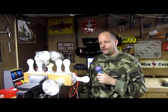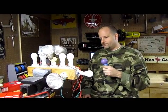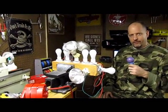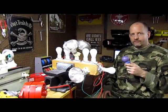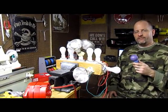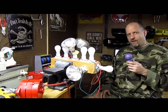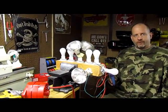So, 500 watts — if you've got about 0.75 horsepower of blade input to put into this generator, I've shown you what you can get out of it. I don't know how much simpler or plainer we can make that. There's a rectifier, here's a load, here's the generator outputting 550 watts or thereabout. We've got a dual PMA that can do give or take 1 kilowatt. With that PMA, if you can input 0.75 horsepower, you'll get what I've shown you in this video. We've shown you that our stators don't burn up. That's basically why you should buy from Hurricane. Thank you.